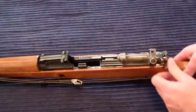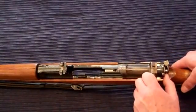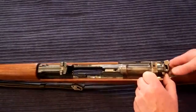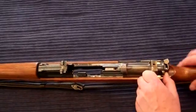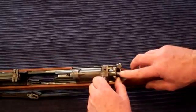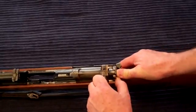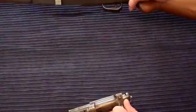In order to do that, we have to firmly hold on to the charging handle, put the thumb behind the receiver here, and then push on this little pin here — see this one? It sticks out. You push it in, and at the same time push it a little bit upwards, and there it comes. That's the whole bolt assembly of a G43 rifle.